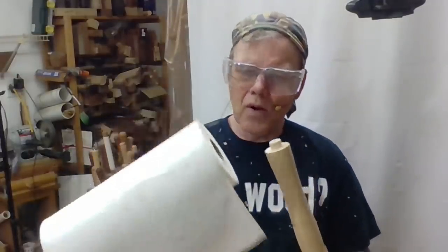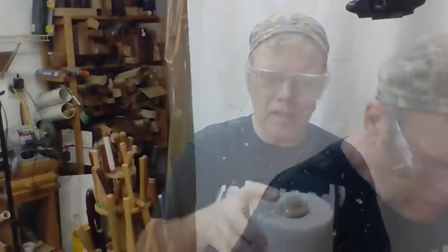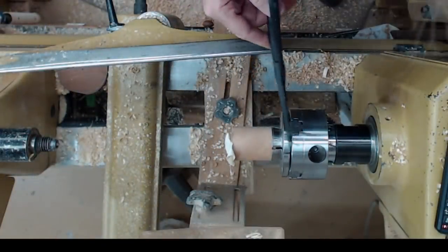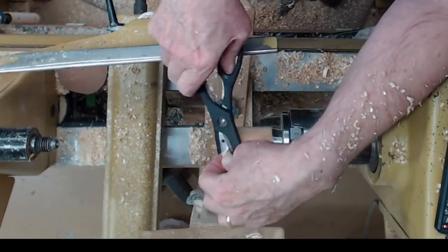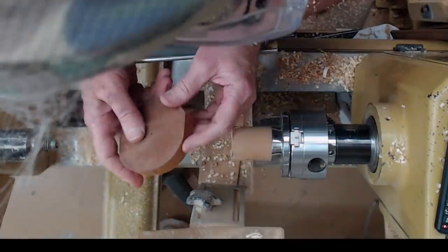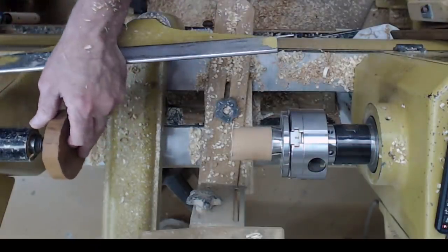It fits nice — I grabbed a roll of paper towels and it shows we've got a little bit of a gap here. Now we're going to turn the removable cap. I'm using 35-millimeter jaws to hold this little scrap I pulled out of my tenon bin that already had a tenon on it — all I had to do was face off the front. I'm reusing the tape we had before, putting it on there in two pieces and just trimming off the excess so it won't get in the way. I'm not sure what kind of wood this is — might be cherry or mahogany — but I've got a center mark on it and we're going to drill this eventually so we don't have to worry too much about any damage.